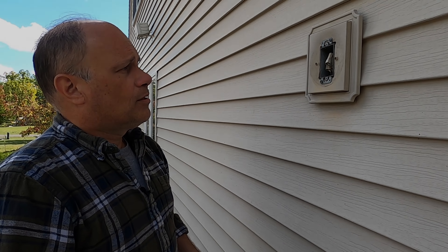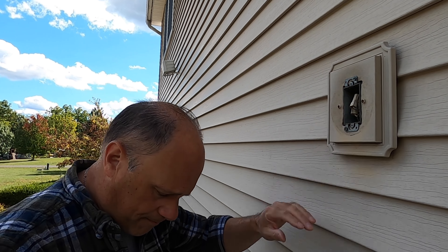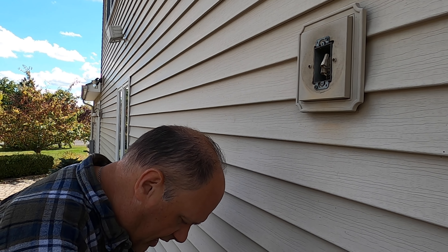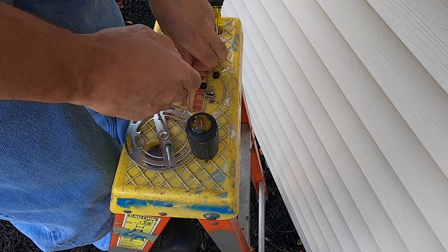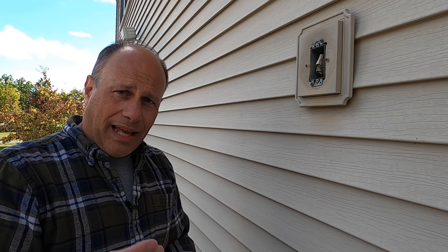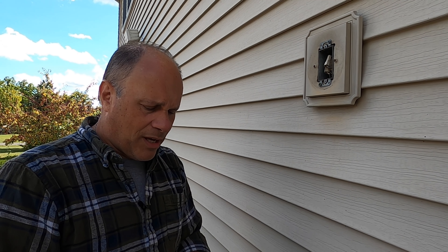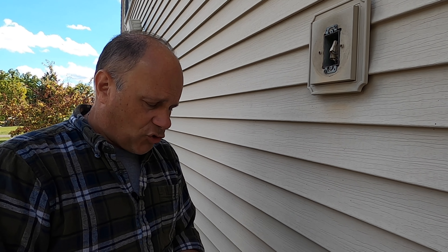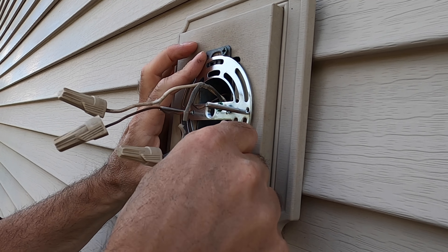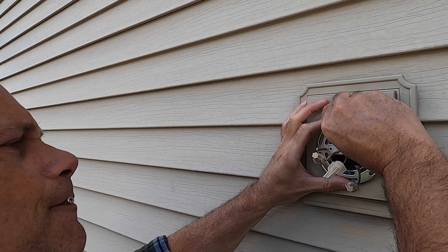You can see we have a lot of broken glass on here. I'm going to remove these two mounting nuts. I'm going to take my gloves off so I have a little more dexterity. Many light fixtures go together with decorative nuts — you want to use finger pressure; you don't want to use tools because you'll mar the decorative finish. Then it should just come straight back to me and you can see the wiring connections in there. Pull that ground out.